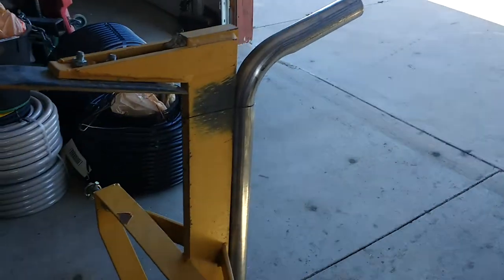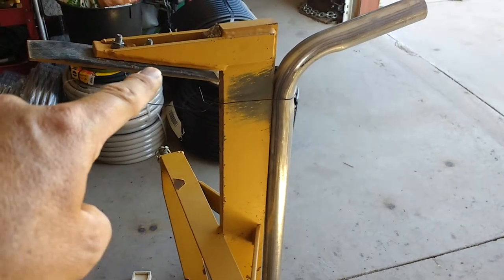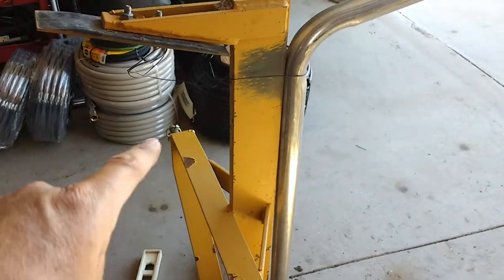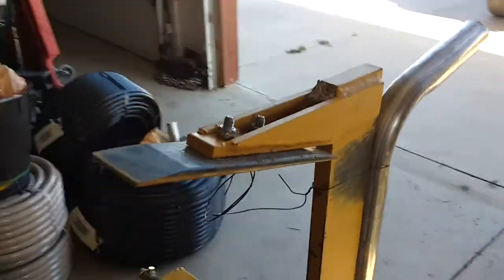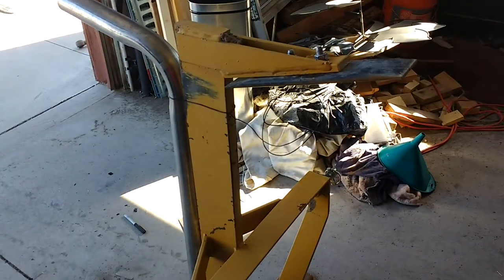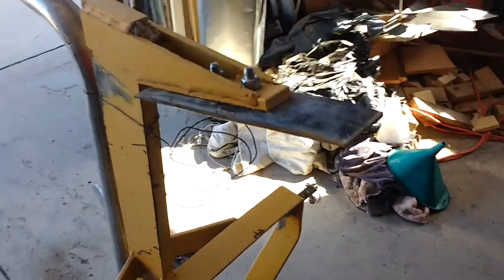It'll be a little bit more resistance for the tractor to drag through, but it never had trouble with the subsoiler. What it did have trouble with — or rather was harder to pull — was this middle buster. I actually got the middle buster blade separate and put it on the subsoiler so I can run it deeper. My 55 horsepower turbocharged tractor doesn't pull it through everything at full depth, but it'll pull the subsoiler blade through at full depth, so I saved a little bit of money buying just the middle buster blade.